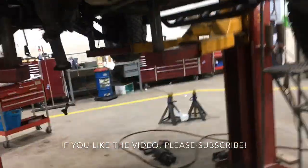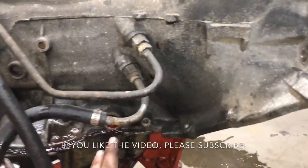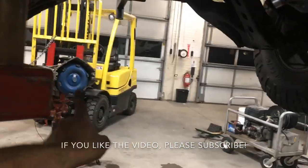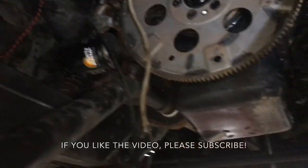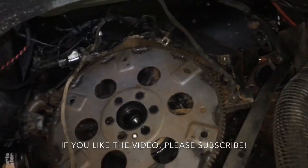Don't forget to disconnect the servo — I forgot to pull it and saw it when I was bringing things down slowly. It's just a 14 or 15 mil bolt; pull the servo out and let it hang. That's also what I was originally talking about when I mentioned the tail speed sensor on the end of the transfer case — I got those two things mixed up. The servo mounts up top, on top of the engine above the flywheel.